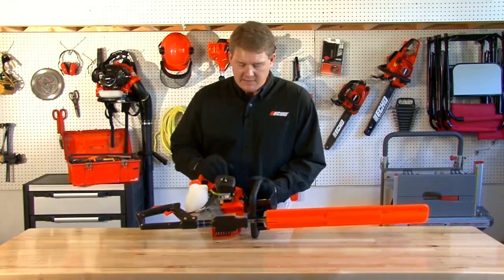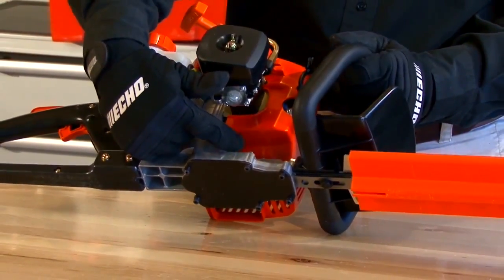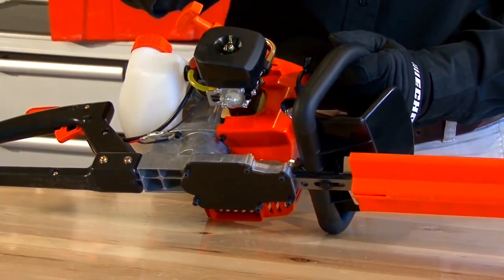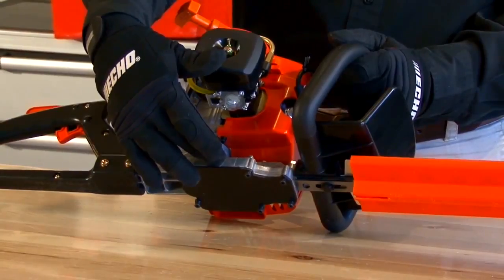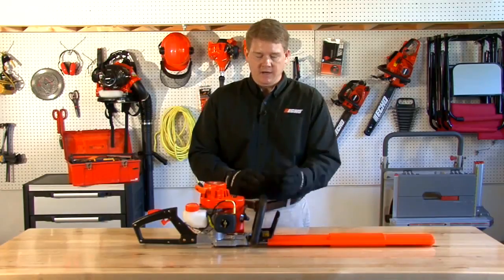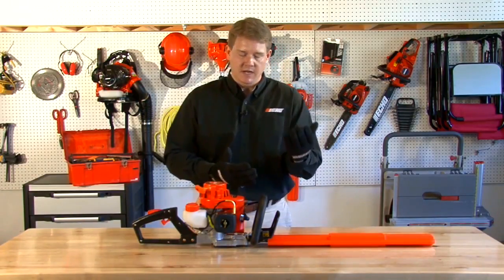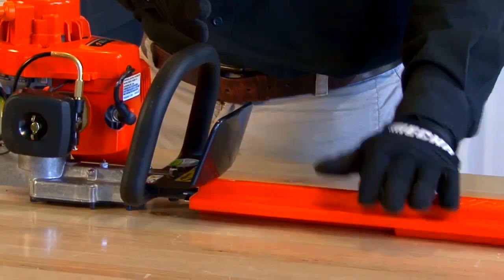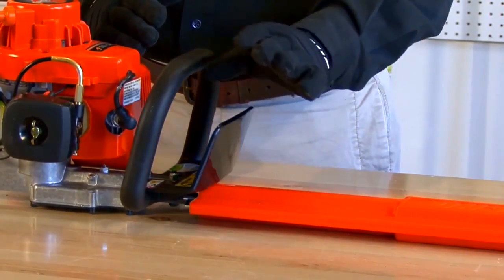You want to make sure that it has a heavy-duty gearbox. This particular unit has a grease zerk so you can grease it — it's easy to maintain. Always try to find a gas hedge trimmer with a heavy-duty gearbox. You also always want to make sure it has a front handle guard, as your left hand is most susceptible to injury from flying debris and is the closest hand to the blades, so get a trimmer with a solid guard for your left hand.